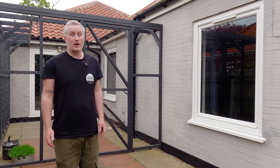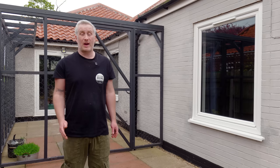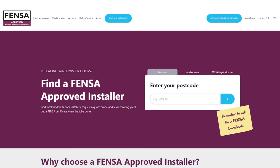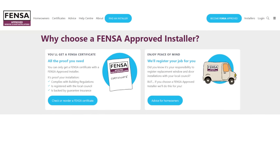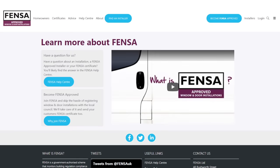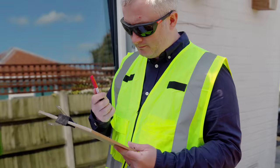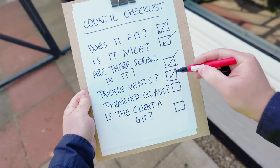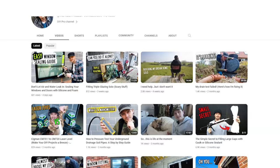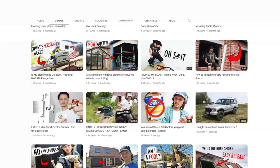So should you fit your own windows? In the UK there's one thing that's really important to note. When the time comes to sell your home the solicitors are going to ask for a FENSA or a building control certificate. There are three options: one is to have the windows installed by a FENSA registered installer who should fit the windows in compliance with building regulations, but it's going to be expensive. Two, you can fit the windows yourself and engage a building control officer to sign off the work that you've done. Or three, you can get either a FENSA or a building control indemnity policy. I got a lot of this information from my good friend Aiden at The Aiden Project — one of my favourite channels on YouTube and criminally undersubscribed in my opinion. I'll leave links in the description box below.